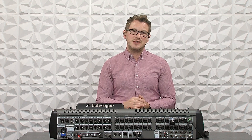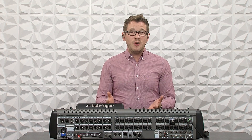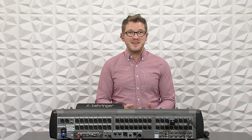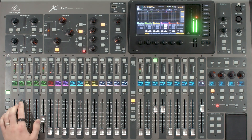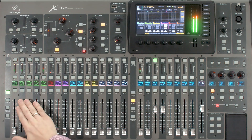So if we happen to excite that frequency more than we want to, that can actually cause wireless dropout issues — things like volume going in and out, the stereo spectrum compressing into mono and back, and high-frequency issues going crazy. I actually have a test setup here. I have my Sennheiser IEM plugged into a stereo DI that's going into my recording, and I want to show you what this sounds like when we have these pilot tone issues. I have some pink noise and a vocal microphone going.